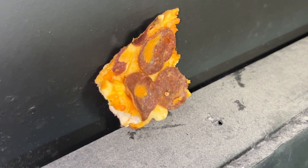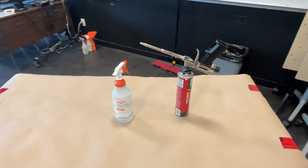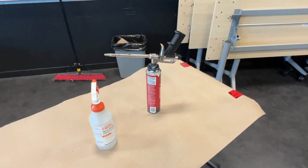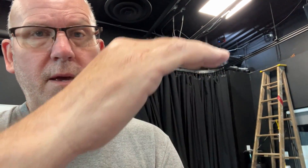I'm going to give it a go with spray foam first and see if I can get some up into that top corner and fill the void where it's accessible. After that, I have a feeling I'm going to need to take mineral wool insulation, cut it into 4-inch wide strips, and friction-fit it up into the notch created by the top of the wall, that steel beam, and the underside of the roof — it creates this little U-shaped or C-shaped channel.